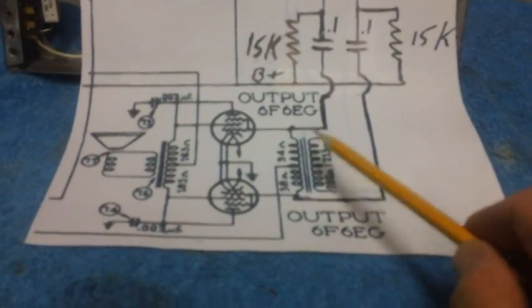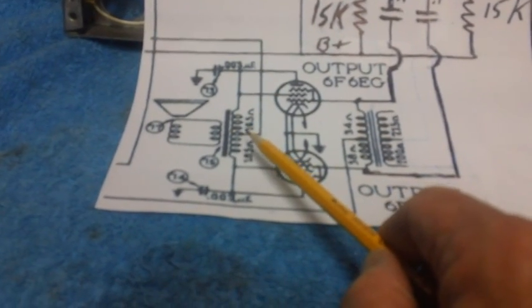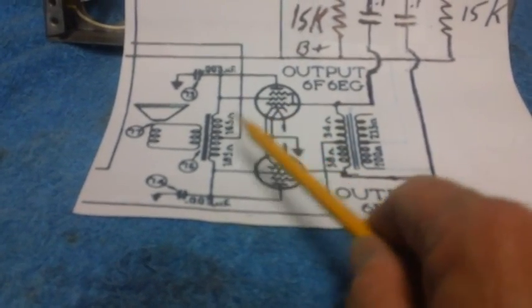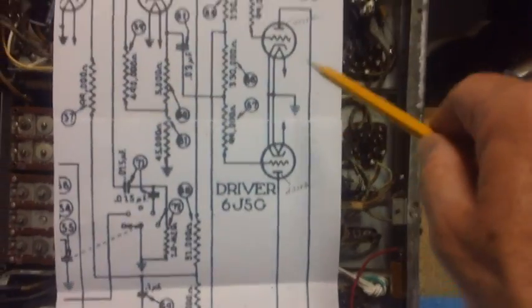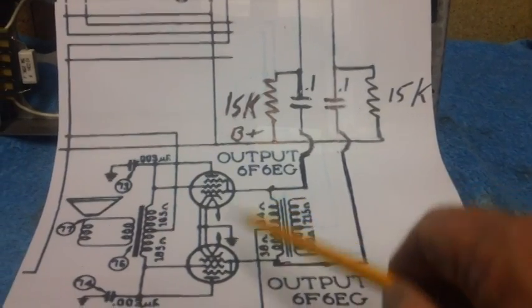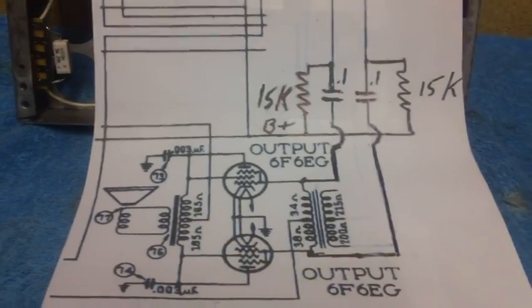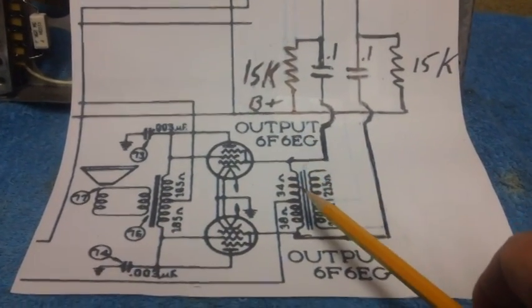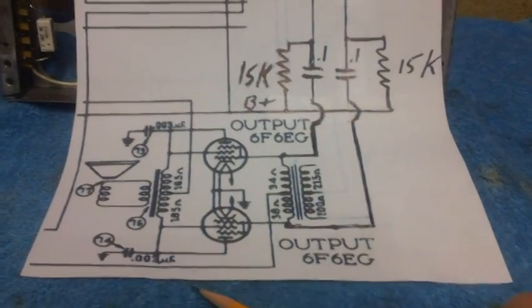There's been some questions. If I bypass this audio transformer, won't I lose some gain going into these tubes here? The purpose of this thing here, from what I understand, is that you go into a push-pull type of situation, you come down here, and this beefs up the signal. It sends it into the output tubes, which amplifies it even more, and then it goes into your audio output transformer. And if you lose this, won't you lose that little extra oomph? I would think so.